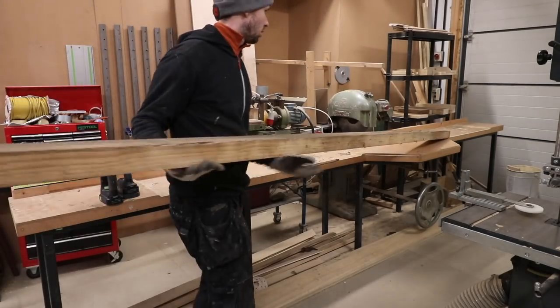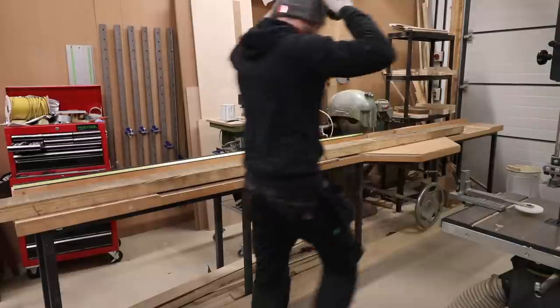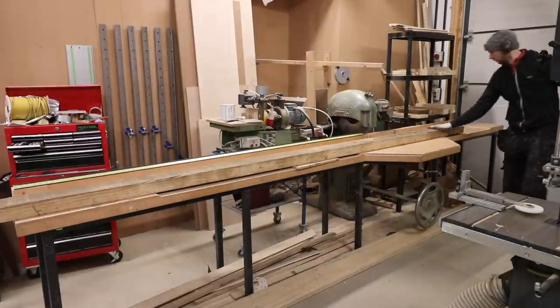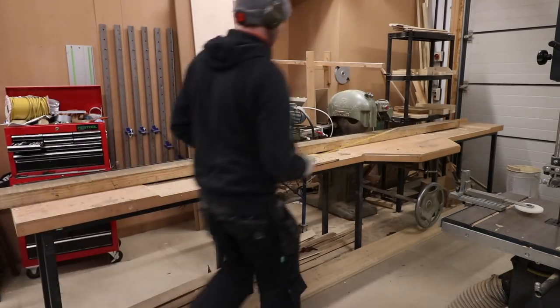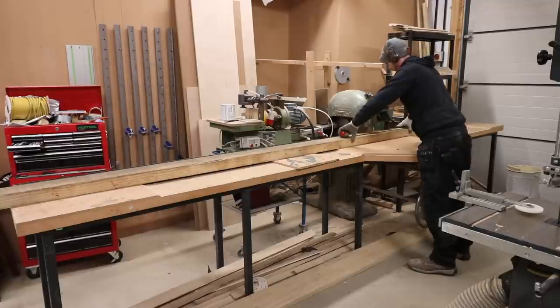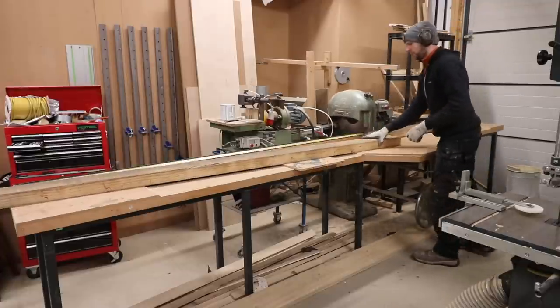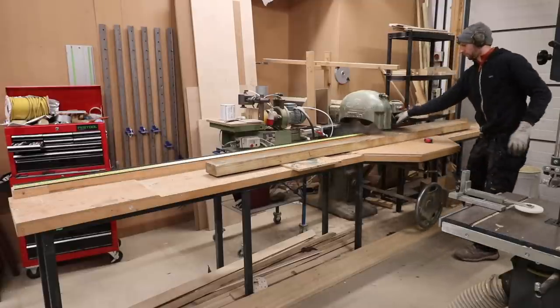I'm going to be using Accoya for this project. It's a little bit more expensive than your average timber that you'd use on an internal joinery build, but you get the benefit after you've installed it, in the fact you don't see any cracking in the joints. It's very stable, there's no swelling or shrinking in place once it's been fitted.